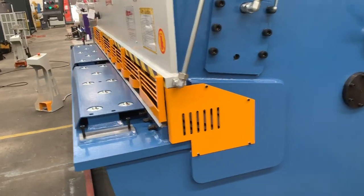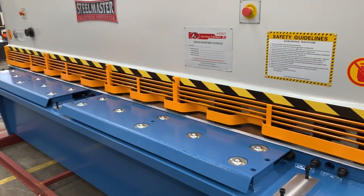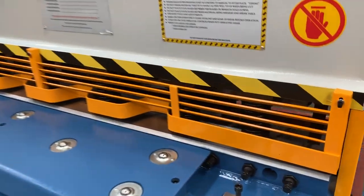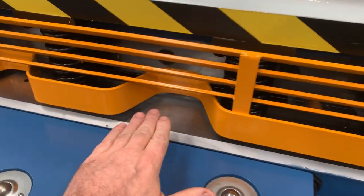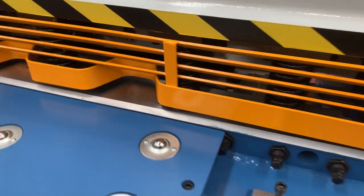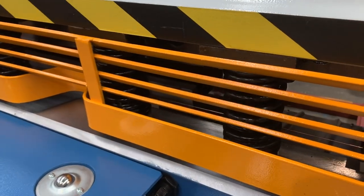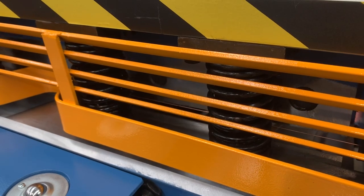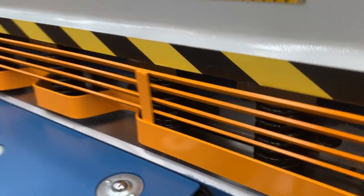There's a nice big deep throat on the side of the machine. Over the years we've added ongoing improved innovations, like the nice louvered front guard, so you can actually push the material right in close to get close to the blade. Being an overdrive machine it has individual clamping jacks — the clamping jacks come down, hold the material, and then the blade comes down and cuts.